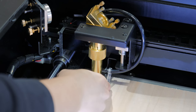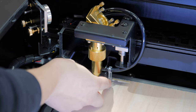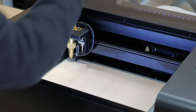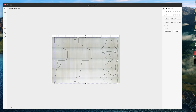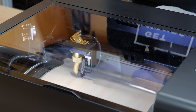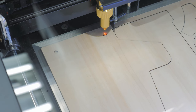The next step is to focus the laser beam according to the material thickness. Beemo comes with a small spacer that needs to fit vertically over the material surface and will give you the correct distance from the laser head to the work piece. I can then import the SVG file that I previously drew on Illustrator and set up the laser power and speed to cut the 5mm plywood. You can find a list of presets and I actually used the one designated to cut 5mm wood. This preset executes the job twice and I found that my plywood was already cut through on the first pass.